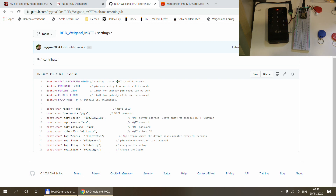The unit comes with a leaflet, and in the documentation section 5 — 'access control mode conversion' — it explains how to switch from standalone access control mode to Wiegand 26 output mode. In that mode the unit outputs all scanned codes on two wires: D0 (white) and D1 (green). To switch modes you just power on the unit with one of those wires grounded, do it once, and it's remembered. Without doing this your code won't receive any codes from the reader.